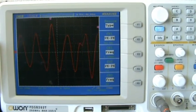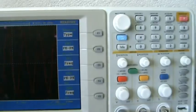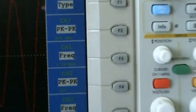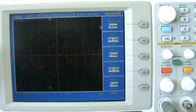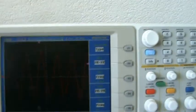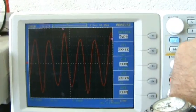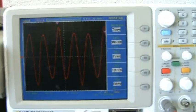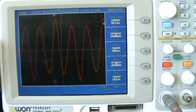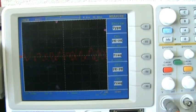So I still see only, I have another resonance point here. I'm now at 1100, so this would be the fifth harmonic of the wave function generator. I have another nice resonance peak here, still at 5.5 megahertz. Frequency is now at 1.8 megahertz, so this would be the third harmonic. And I go now all the way up to the edge of my wave generator.